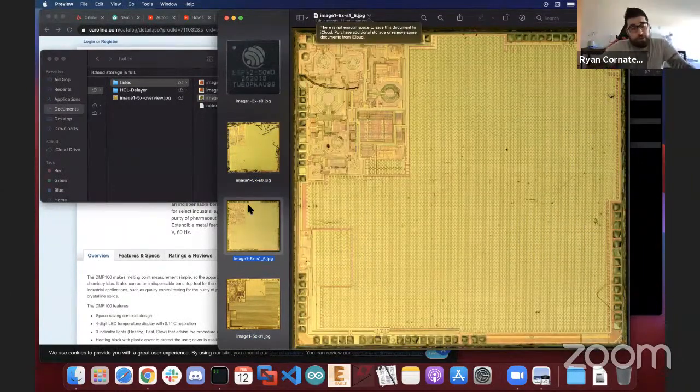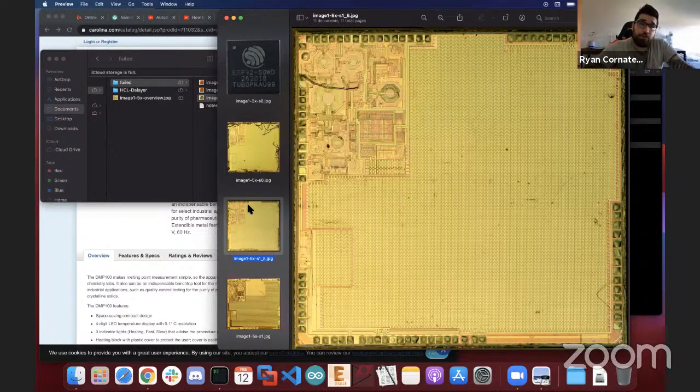So what John told me to do is do everything in intervals. Because we are dealing with both potential aluminum and copper layers, we can use hydrochloric acid with hydrogen peroxide, I would say at a 1-to-1 ratio.